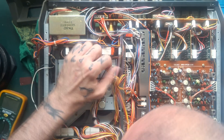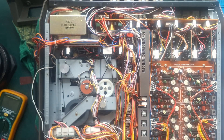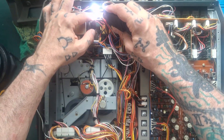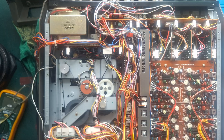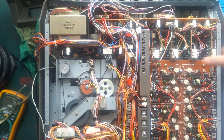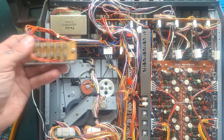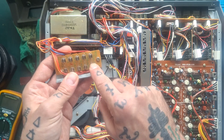The tape cue is P304 — I believe it's this red one. Difficult to see the writing beside the socket but I'm confident that's correct. The meter is P805, a 4-pin connector from this board to the meter — shining a torch in behind the socket confirms it. J705, connecting to the record and playback board, I'll pull out with pliers — yes, that's J705. J101 I assume is this one; it says so on the board text, though partly obscured by the socket. With all those connectors unplugged, I'll get the camera set up to capture the moment when these two fuses blow.